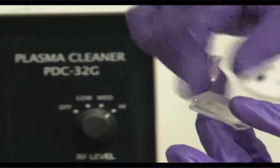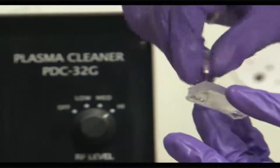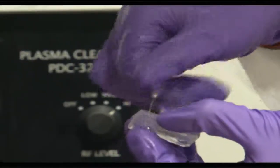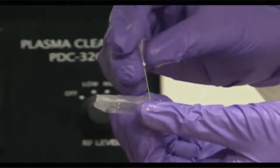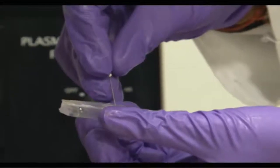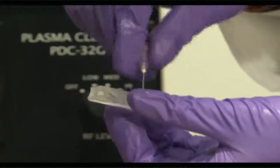Fantastic thing about this is it's a rubbery material. So whatever small channel has been created across the thickness of this PDMS can be easily cut, or cut this port in the thickness of the PDMS. The advantage of PDMS is that it is a highly elastic material. So if you put a small piping or a tubing inside this drilled hole, there is always a tendency of a self-seal to happen between the thickness of the PDMS and that pipe or tube, and therefore you can easily, in a very leak-proof manner, handle fluids into this small structure which has been embedded on the bottom of this PDMS layer, and closed subsequently by a glass wafer.